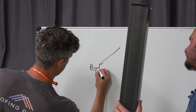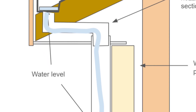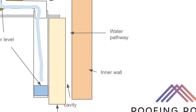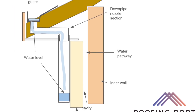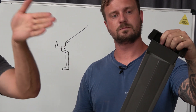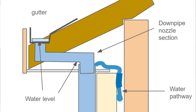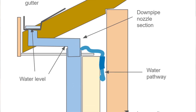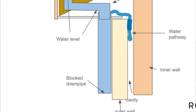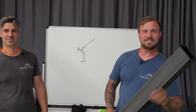The odd thing about this is - if you have a downpipe blocking at the bottom on the outside, water just overflows on the outside of the house, pops out around the nozzle and runs down the exterior - not really a problem. But when it's internal, underneath an eave, with a soffit board coming across sitting on your brick wall, that overflow water has a track to go straight down the internal wall, find its way down, hit the ceiling, running down wall cavities - which is what we found.